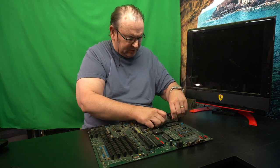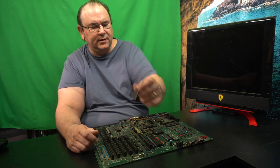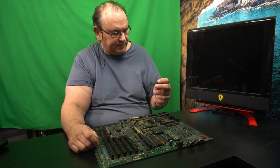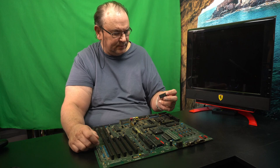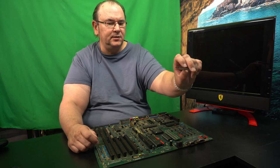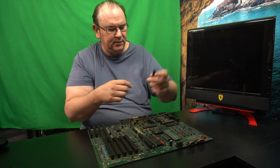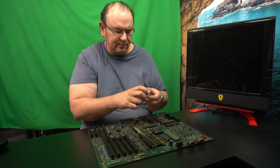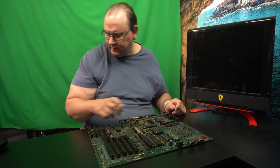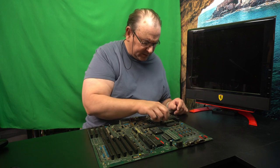When I was doing the chip swap, sadly this one lost its leg, and that's an indication that there's a bit of corrosion going on in the board, because I thought I was being as careful as I could. Now this can be fixed — I might actually add a small clip of how you can address this. This is not serious; there are several methods to get that quite nicely repaired.